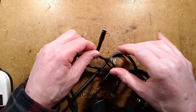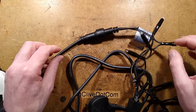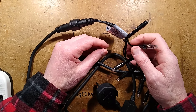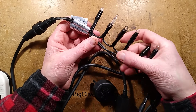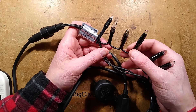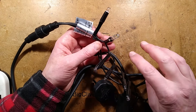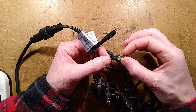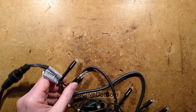If we take a look at the construction of these, they are potted. They've got the thick rubber cable — the H05 rubber cable, which is rated for outdoor use and very resilient to weather. They've got the rubber cable continuing along with these strings of lights, with the bus bar of the plus and minus rectified voltage going along at full mains volts — in this case 240 volts. Then they've got the cluster string going along tapping in at specific points. Where the wires go in and where you get the LEDs, they've actually got little resin cups — I can show you an actual picture of the resin cup.